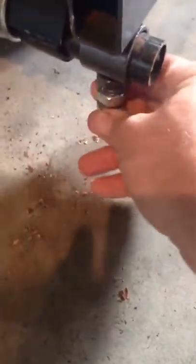The other thing is that when this thing comes, this cover plate here is oriented like this. There are two bolts down here — this just rides on a rod. What you're going to have to do is once you get out to the field and pick this up with the three-point hitch, get this down where you want it, then tighten this up. When you put it down on the ground, it'll put some back pressure on it, and that's to cover the seed.